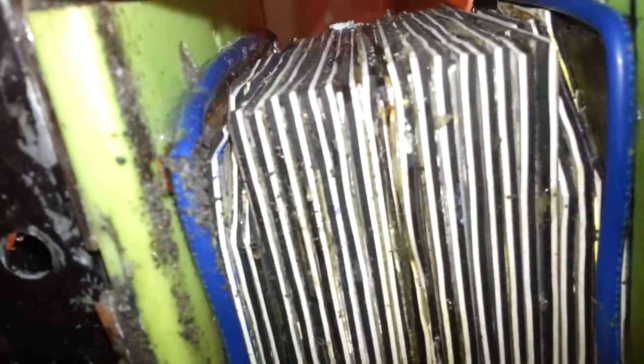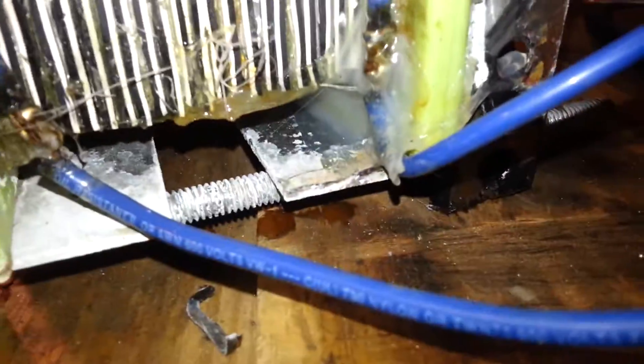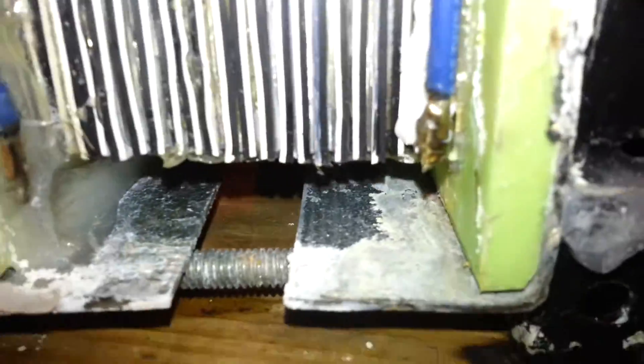As you can see, I have multiple attachment points on the terminals — there's a point there, two points attached there, two points attached there. That reduces heating significantly. When you're cranking 20 amps through stainless steel, you're going to be putting off about 240 watts of heat.